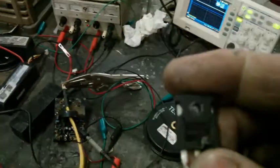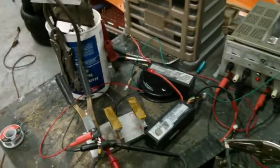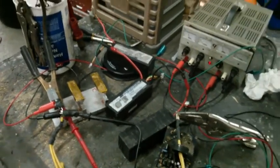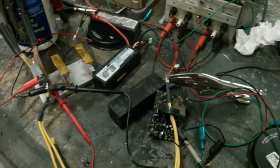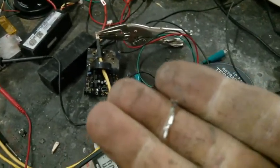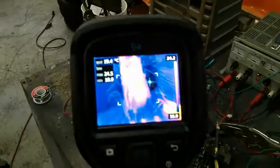Nonetheless, that hit 145 on an IRFP4568 MOSFET, which is 147, something like that. But yeah, it's really cool. Nonetheless, I did try 4 packs in series, which bumped it up really high, and it just melted the source pin right away. It blew it up. I kind of expected that. Got it on video. It's cool. There's the source pin. I could tell the video prior to that was about to happen because 147 amps was making the source really hot inside the MOSFET, and my thermal imaging camera actually showed that, so it was really cool.